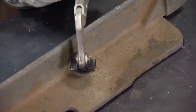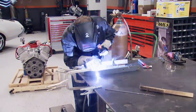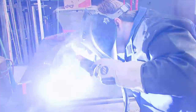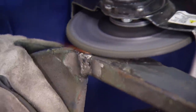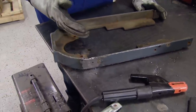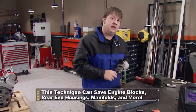Cleaning up the edges helps keep any nastiness out of the weld and broadens the surface area of the welding joint. Using the outline I made on the tabletop tells me exactly where the pieces need to go and I can begin reassembly. Some clamps make life a lot easier. I'll make a quick little weld on the outside and follow it up by pinging it with a hammer, lightly. What this pinging does is two things: it removes the slag while the weld is still a little bit hot, and it relieves stress in the weld. With a touchy procedure like welding cast iron, taking the stress down while it cools is a must. The actual weld pattern you use can be the same here as you might use when MIG welding or stick welding typical materials. I'll dress up the welds with an electric grinder and that's pretty much the size of it. This can be kind of a bear to master, but there's nothing wrong with finding a few old pieces and practicing. This technique can be used to save some of those hard-to-find rare parts, and that in itself will more than pay for itself.